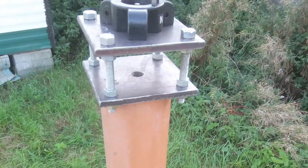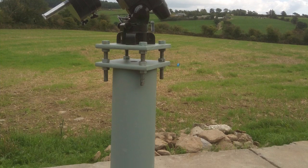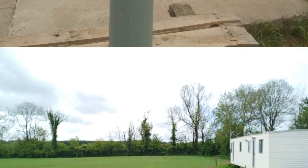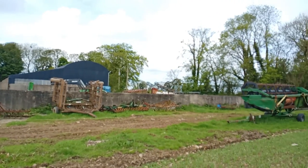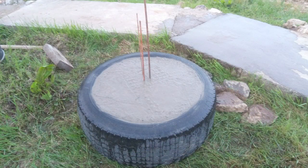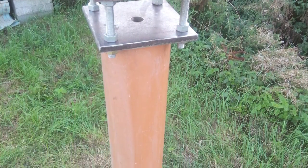Taking a look at my own pier build, I actually used a 6-inch plastic drainage pipe for the main pier construction. It has rebar going through the concrete and down into its foundation. But my foundation is different from most in that I could not dig a big hole in the ground because the ground does not belong to me. What I did was use a big old truck tire — actually a grain trailer tire — and filled that with concrete with rebar sticking out and then the pier construction above. This pier can be moved, albeit by forklift truck. So if you're renting and can't dig into the ground, this could be a solution for you as well.